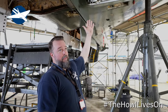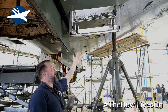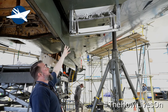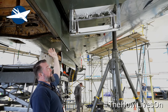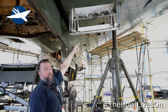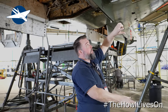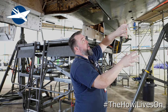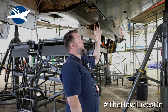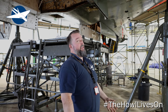Air brakes — you'll notice on top of the aircraft there's two flaps either side, and on the lower there's only one either side, just a design feature. They're chain driven — there's a system of gearboxes, drive shafts, and chains. The sprocket drives the chain and the post will come out and go back in. Unless you get a chain snap — it has happened. So we're going through a process each winter of changing the chains. It's belt and braces — let's do things right and do it once. We don't want any more issues with air brakes.